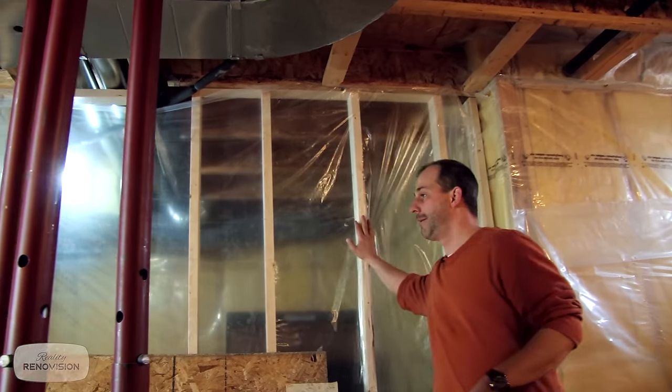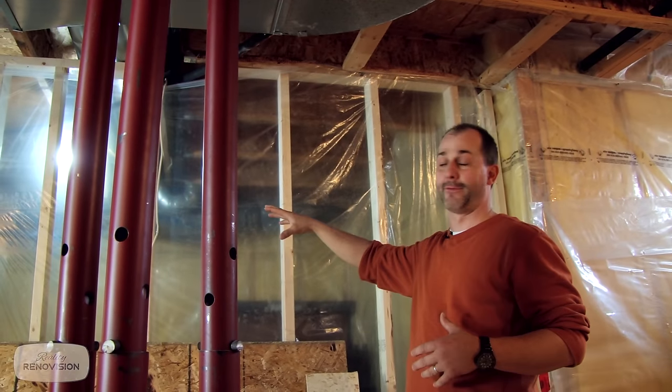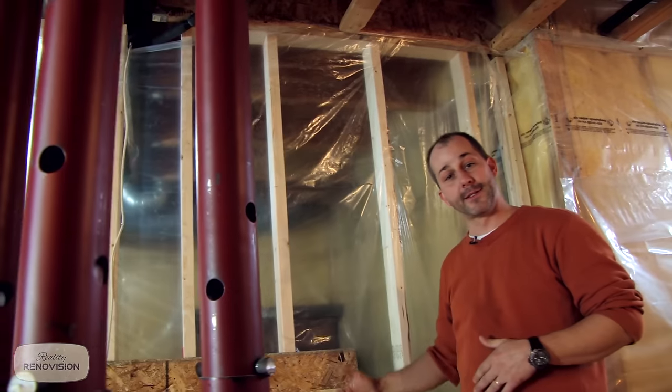We've framed this wall to isolate the living space from the furnace area. Temporarily it's covered in plastic just to keep the dust down — they have a mid-efficiency furnace with fresh air mixed into the basement air. Behind this wall we'll bring two heat runs right down to the floor. Basements are very difficult to keep warm in the seated position; heat from the ceiling tends to come about halfway down then work its way back up. So we bring the heat right to the floor, and on the other side of the room we bring in a cold air return at the floor, pulling warm air across the floor and keeping it low as long as possible.